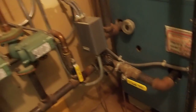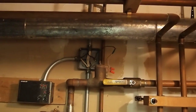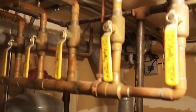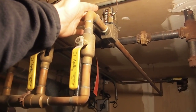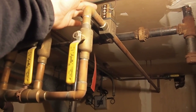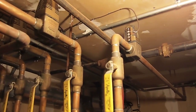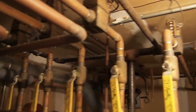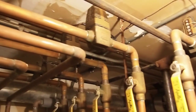This pipe sends the water out to the rest of the house through a fairly elaborate system of copper pipes — mostly copper pipes. There are some plastic pipes over here, but I'll explain those in a moment. Up in the piping system here there are valves that turn the water flow on and off based on the signal that comes through from a wire sent from the thermostat, which is up in the living quarters. Each one of these little units has the ability to turn water on and off in various parts of the house, and then water goes out and can flow back as well.